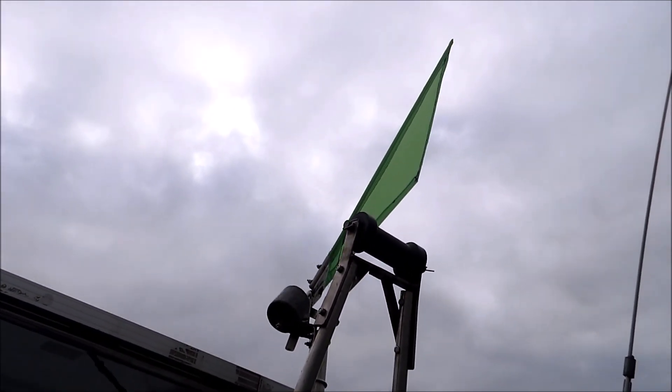The vane consists of a small aluminium plate attached to two one metre long 10 millimetre aluminium tubes. The top is held apart by a 50 centimetre long piece of high tensile fencing wire. Parallel plates in the vane head hold the vane, which is secured by a bolt and a wing nut. The vane is covered with lightweight nylon, keeping the whole vane as light as possible.